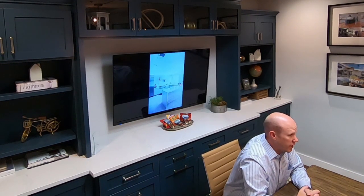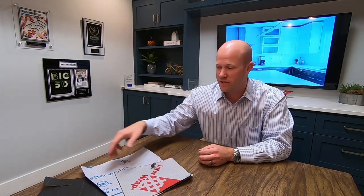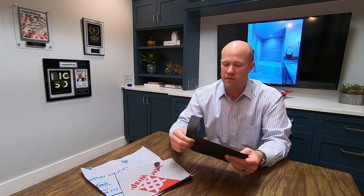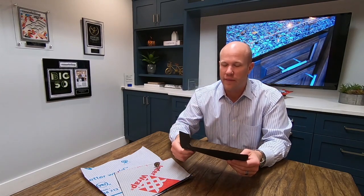I heard a statistic, which I do believe — I haven't tested it myself — but an average roof has 8,000 nails used in it. So imagine having the synthetic and the ice and water shield as your last protector for rain, as opposed to the felt. That's exactly why we only use these. If you ever see 15-pound or even 30-pound felt — that's a notch up — it's really not the best. It is less expensive, I can't argue that, but it's not the best long term. Keep that in mind: the underlayment, in my opinion, can often be more important than the top layer — the actual roofing shingles themselves.